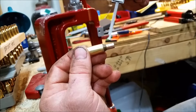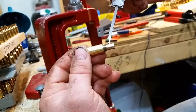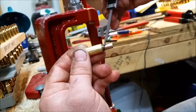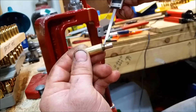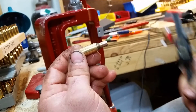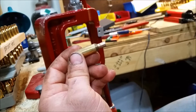Once I've got that done, I'll go over to my other lathe and put the neck turner on. It will just touch up at the front of the mouth and turn down, and it takes more off. When you're turning, you need to get down to the neck-shoulder union — just a touch. This will be the seating issue problem right at the neck-shoulder union if you get it too thick, especially once you seat the bullet. We'll go over that in the next step, and I'll have the reamer figured out for the 257 Bobcat procedure.